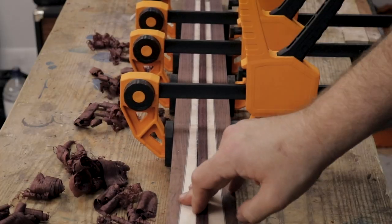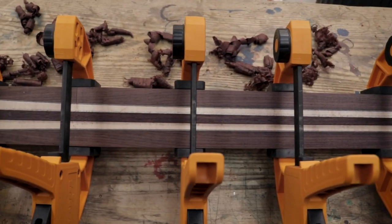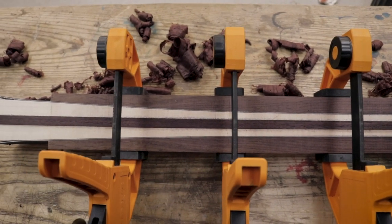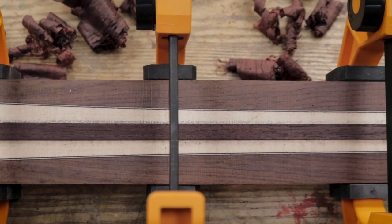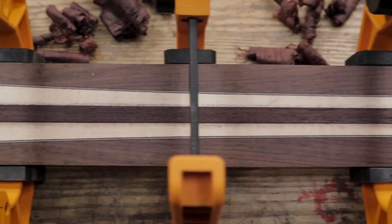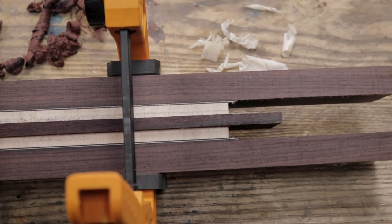That is what I am talking about. Obviously, I am minus the extra black, white, black purfling as of yet. But that curve in there, that is what I'm after. If you look at the grain in the rosewood, you can see why it has happened, actually. The grain at this end is going in, and it's doing the same thing at this end, and that's making it cup.